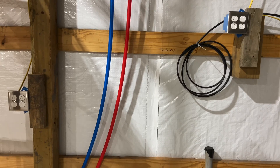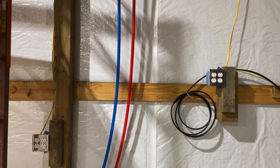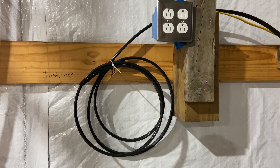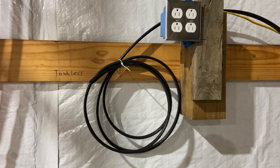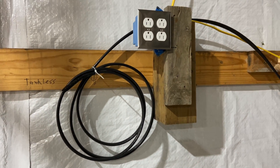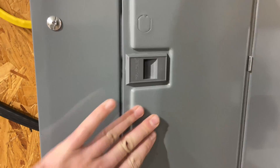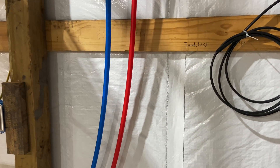So I'm going to give you a tour. Those are three-quarter inch lines coming in. I've got a cold line coming in, and it's going to go to a hot water tank. I actually got the tank and got power to it. I went with an electric tank — as small as I need out here in the shop, it was cheaper and simpler than dealing with propane. So that's running on a dedicated 50-amp circuit using 6/2 Romex.